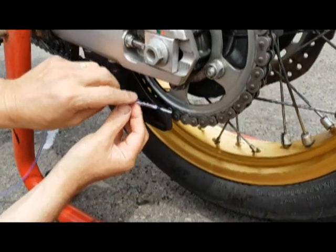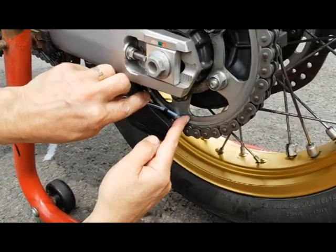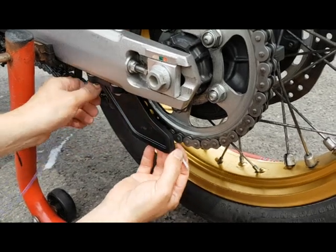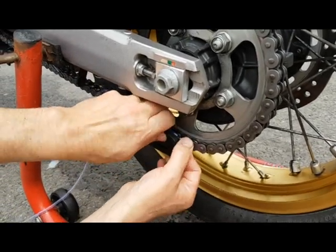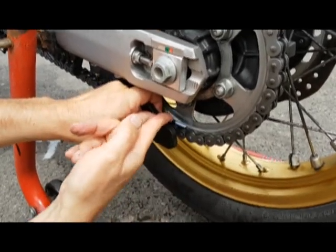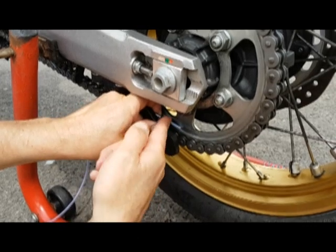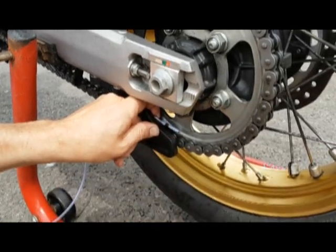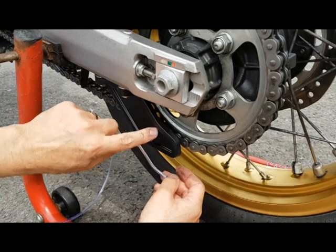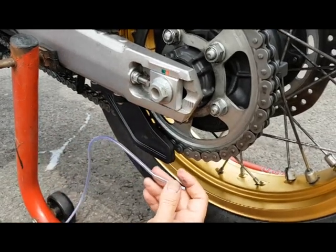What we want to do is place the single feed nozzle so it's just here against the sprocket and in this gutter, just at this point. So I'm going to secure it behind the fin here so that it's held tightly in this position, and then I'll be able to push it over so that it rests about there. To secure it, I'm going to drill two holes in this plastic chain fin, which won't hurt it at all, and then I'll secure it with a couple of cable ties.